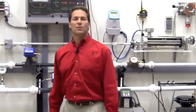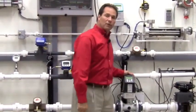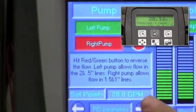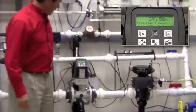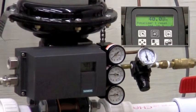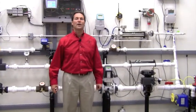If you'd like to see the valve operate, let's turn the pumps on and watch her go. Here we have a mag meter that's measuring our flow rate. Right now we're at 28 GPM. I'm going to come up here to my controller — my set point right now is at 28 GPM. Let's change that to 41 GPM. Come back here, watch the valve react, watch the flow. And as it climbs up, we're going to watch it stabilize at 41, or awfully close to it. There you have it — good accurate control in a small lightweight body.